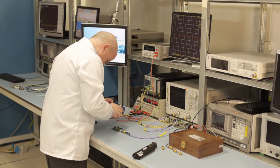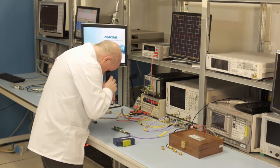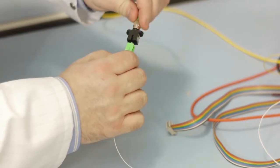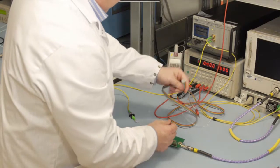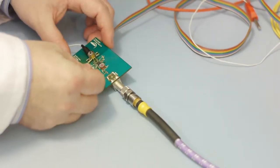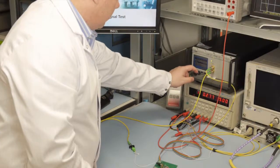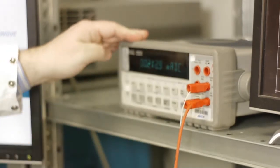The photodiode on the DUT was cleaned and inspected with the fiber microscope. The photodiode SC APC connector was attached to the optical fiber cable coming from the optical attenuator. The DC bias was connected to the DUT PCB with a ribbon cable. The optical power and DC bias were then turned on. The ammeter was reconnected so that the current from the photodiode could again be measured.